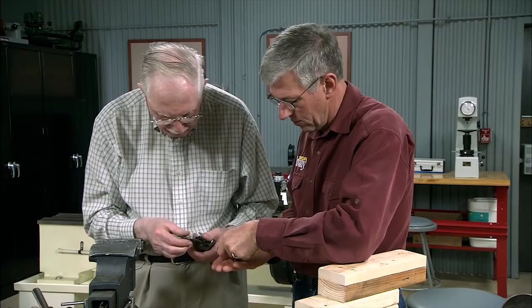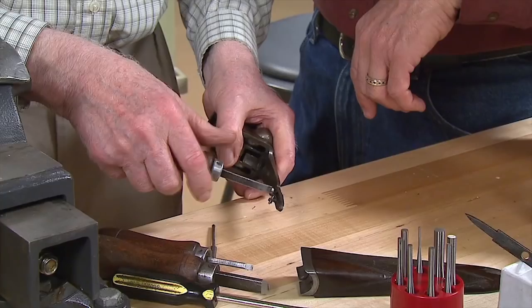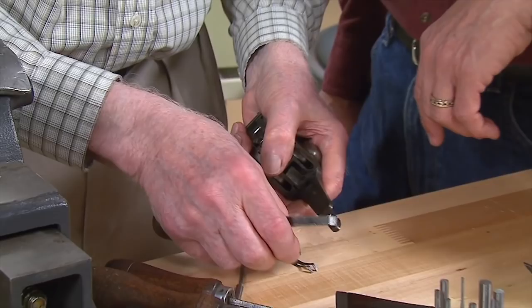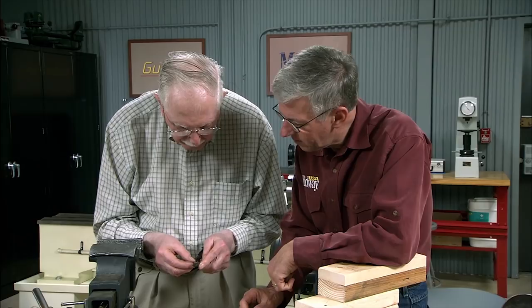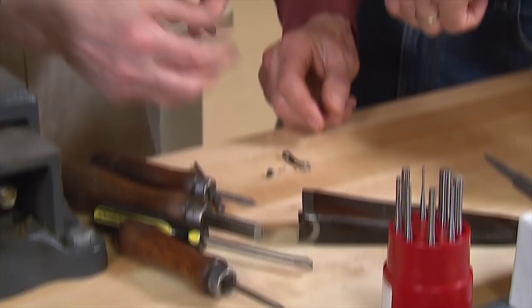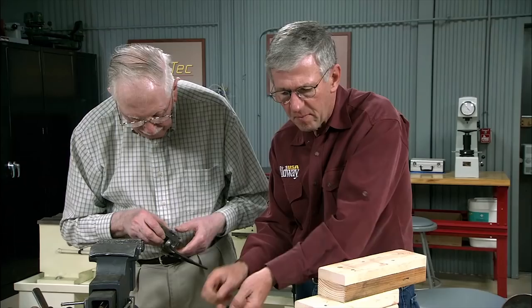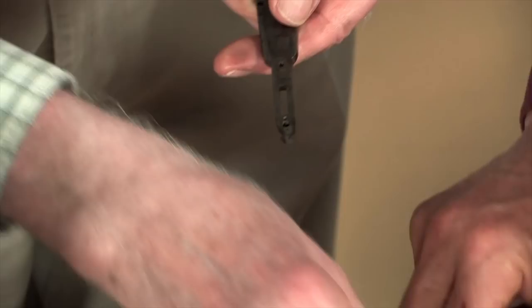You can undo this pin — it's a little pin — and off comes the spring. And then underneath there, there's just a pin through part of the safety thumbpiece, and it's just dropped out. Here it is. Take out the safe thumbpiece, or safe button if you want to call it that. And then you've got everything out of the top strap.